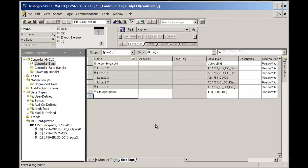So basically, if you were trying to picture this in your mind, it would be an automated storage and retrieval system. When you look down this warehouse, you see 2 rows of spaces, 10 spaces high, back to back, and in between each 2 you see a rail, like a railroad track. On that track there's a lift or crane, if you want to call it that, that travels back and forth and can place unit loads, skid loads of parts or product on either side of the rail. I don't know if you can picture that in your head or not, but the Logix engine gives you the capability of 3-dimensional arrays. Very cool. Maybe hard to picture virtually.